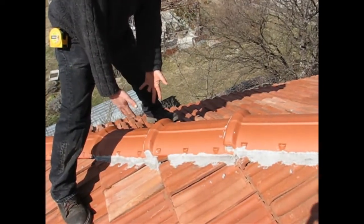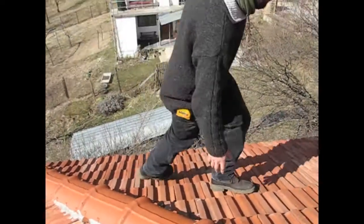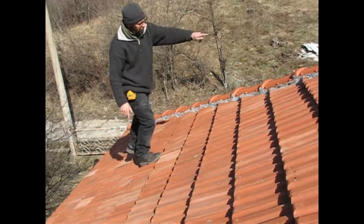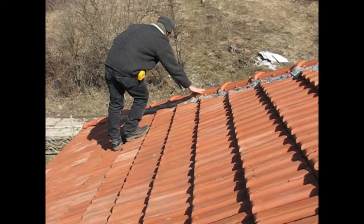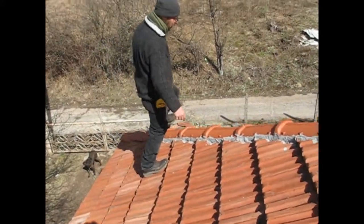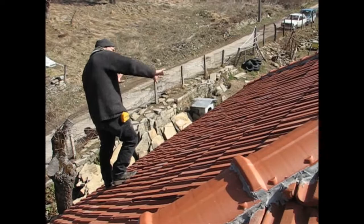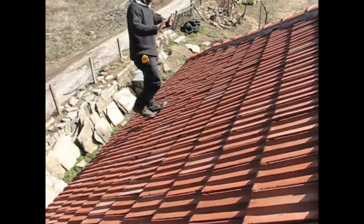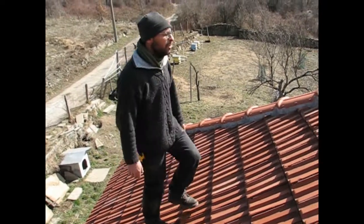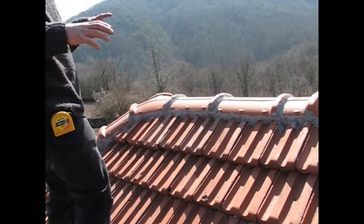When you're walking on the roof, step far from the ledge itself, because you can move things. We're going around clockwise — step far and keep going. Inspect the tiles, inspect the quality of the ridge caps. Our new ridge caps look good, I'm happy with the mortar. Down here we'll mortar this once the gutters come on. I'll walk down over here and look up, looking for dips in the roof and black tiles. Anything that doesn't look good will get changed. Once I've gone along the whole roof I will go up to the ridge and give it a thorough inspection. If there are any chimneys, I'll go over those too.